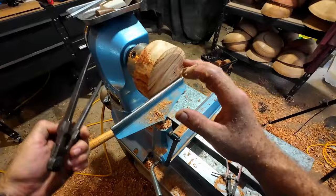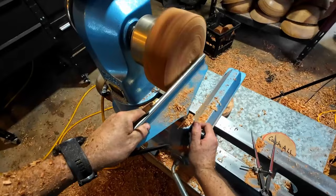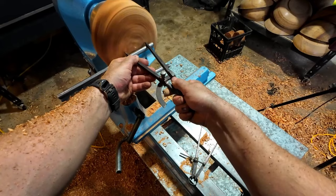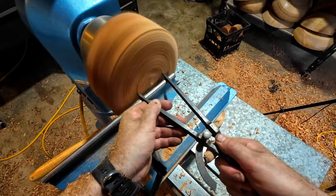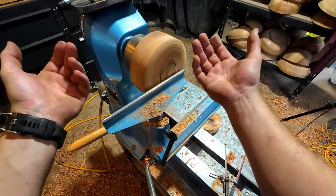I'm going to raise this up to centre height and mark our tenon. I don't normally mark the tenon to start with — I normally remove all the weight first. I'm just going to shape this bowl up the way I want it. Also, never stand in front of the lathe in the firing line as much as you can — you might get hurt. I'm going to bring that side down to get rid of the majority of the bulk.